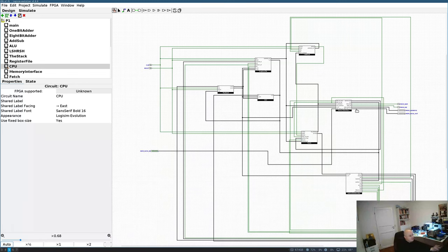I'm going to have a separate backplane board with a set of identical connectors, and this board will handle all the connections between the modules — all the connections you see on the screen right now. That backplane board will be technically passive, so there will be no logic, but I think I will put some debugging LEDs and a power supply on it. This board will provide both the power and the connections.